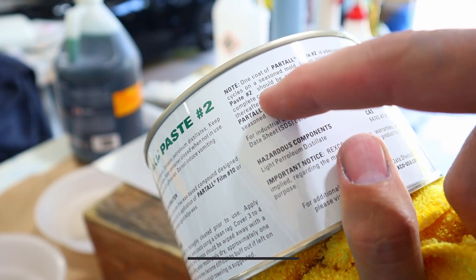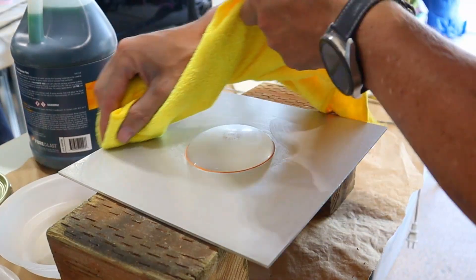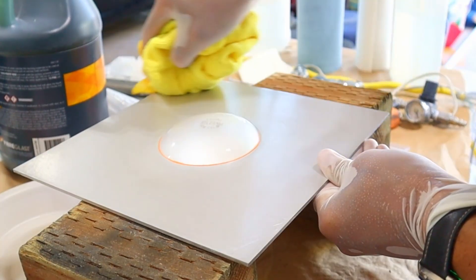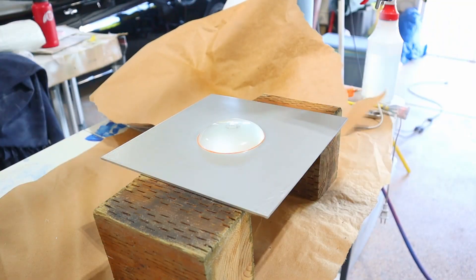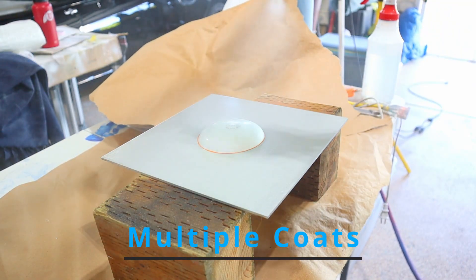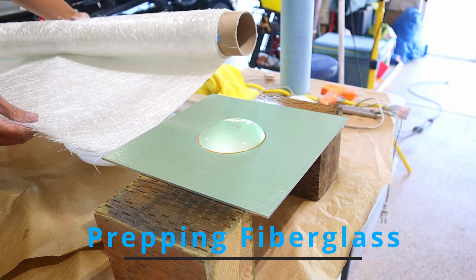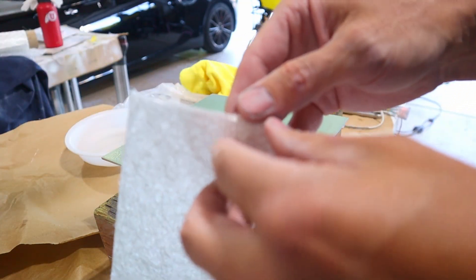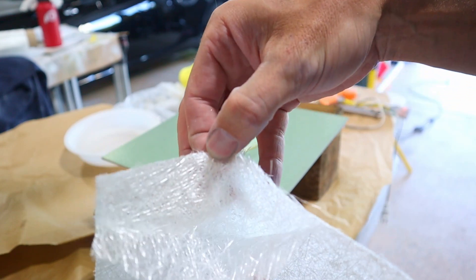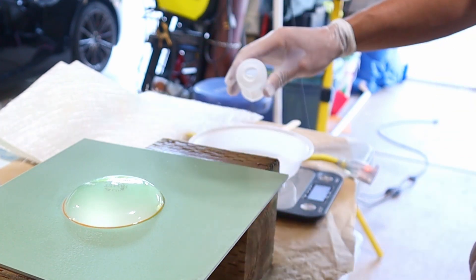For the directions it says, like on the first mold, it should be buffed out three to four times. For the first layer, you want something that's pretty thin and will mold well to those lines. I've just got some fiberglass mat, but one of the tricks I've learned is the fiberglass mat is actually like one or two mats kind of together. They do sell the thinner stuff, but you can also just get the thicker stuff and peel it apart. This will conform a lot better to those curves, and I like to do that for the first layer.